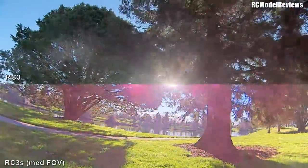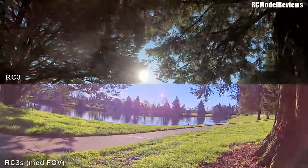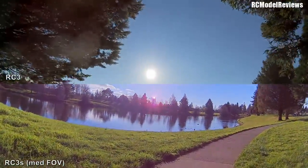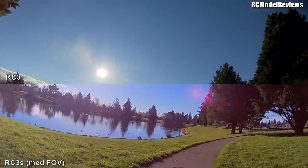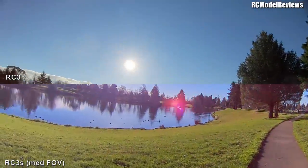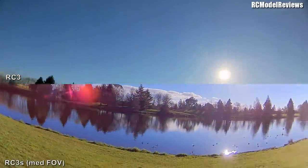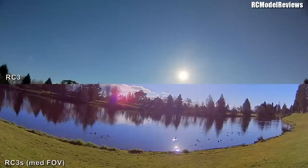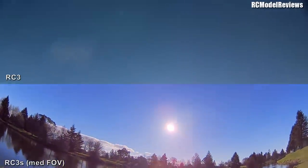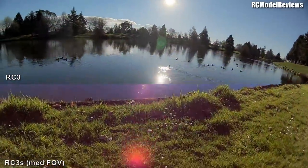Now, here I've done another walk, won't go the whole way, but I've split vertically and horizontally so you can see the field of view. As I say, Runcam 3S is on the medium field of view, Runcam 3 is on full field of view. So at this point, they basically have the same field of view. So if you're going to use the wide field of view on the Runcam 3S, you're going to get a lot of distortion at the very edges, and it's going to be wider than the original Runcam 3. So it's quite important to know. And again, look at the lens flares. You can see lens flares in the top, which is the Runcam 3. They're a very light and indistinct color, but the bright orange is on the bottom.